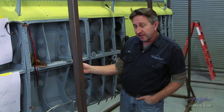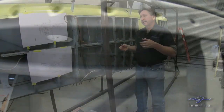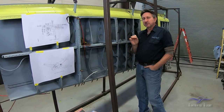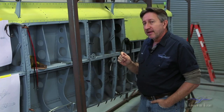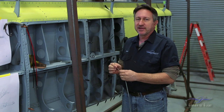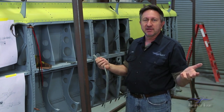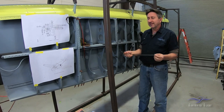We've got new wiring that we ran through, and all the wiring on the 108 runs through a series of either flexible or rigid conduit — you can see it runs all the way from the wing tip to the butt of the wing. We're trying to make it look the way it's supposed to look. A lot of the wiring on the 108 went through different conduits, sleeving, and an actual outside shielding on top. Some of this stuff is kind of hard to find. You have to go past aviation supply shops because this airplane was built in the 1930s, when places to purchase aviation parts didn't exist.